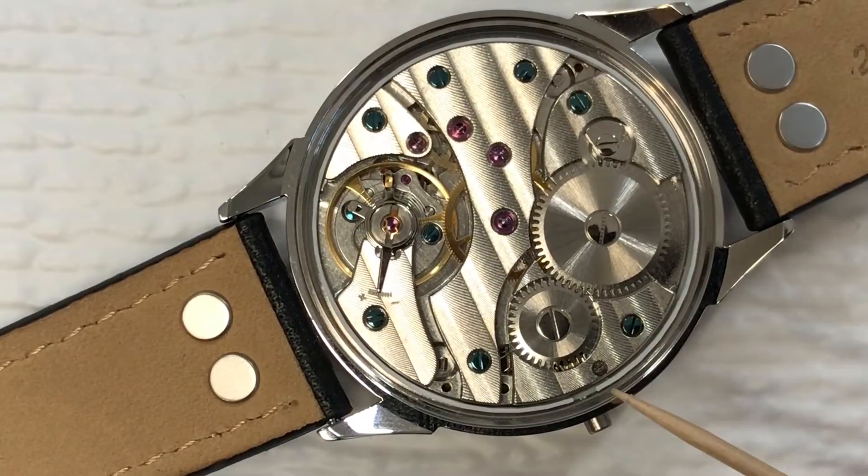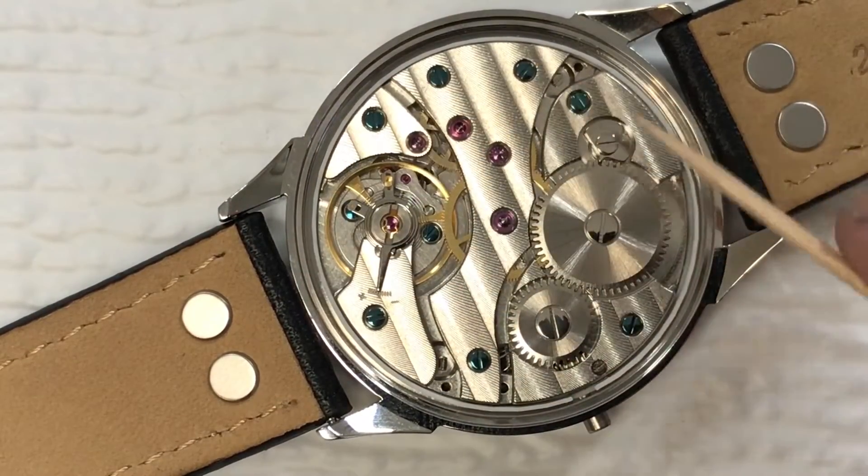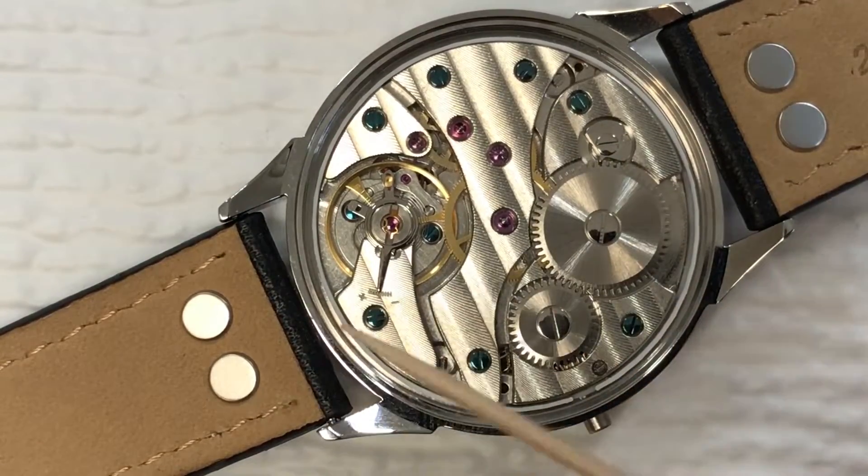Tap it around a little bit and if the dimensions are right it'll shift down into place, then you can put the stem in and it's good to go. One key point about height: if this ring were too tall it would interfere with the threads for the case back and prevent it from screwing in properly — so the height has to be exactly right. This is a very specific step, but it's an important one to show: building custom prototypes sometimes requires custom parts. The movement is just a little too small for the case, so we add this cushion so nothing moves when wearing the watch. Next video we're casing the movement and the watch will be done — thanks for joining me, subscribe if you haven't, ring the bell for updates, check out watchcomplications.com — I'm Brian, I'm out.